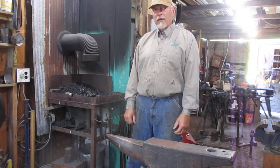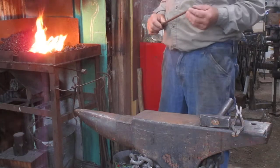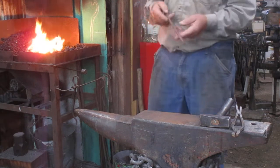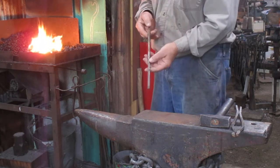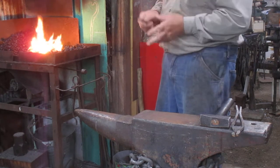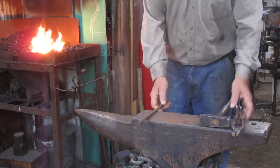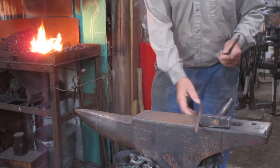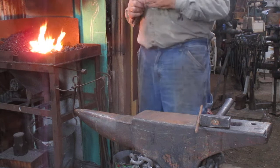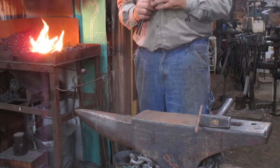Stick with me and we'll get started in just a second — I'll be getting this coal forge up and running. Welcome back. I now have the coal forge operating. I will be using a piece of three-eighths inch round bar today to draw the leaf finial from. The coal forge is an interesting thing — many people ask whether you forge in coal or in coke, and actually the answer is that you forge in both.